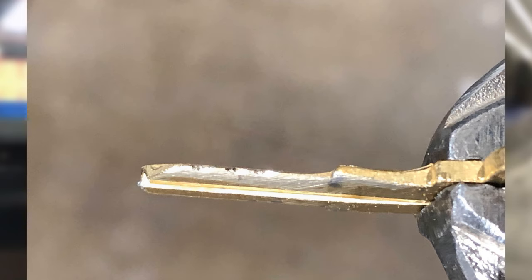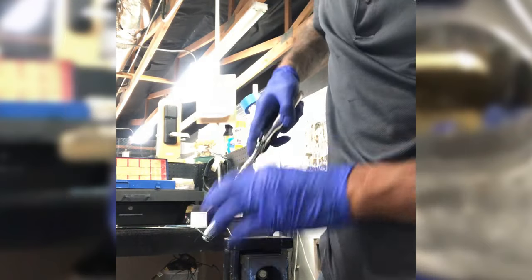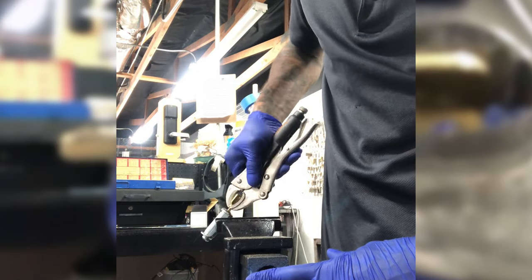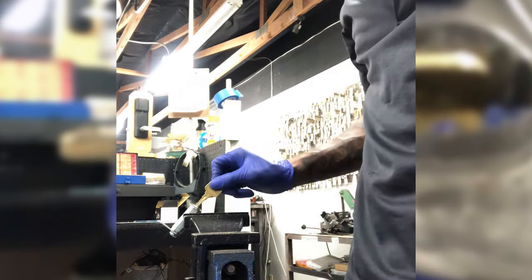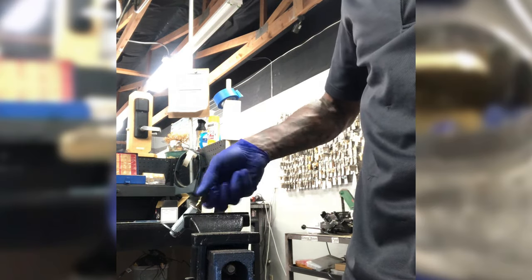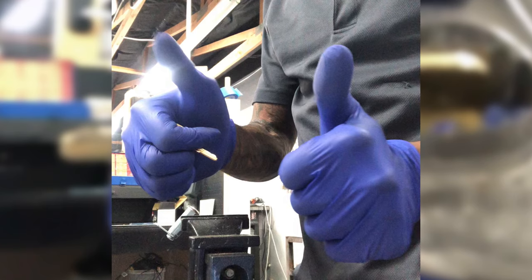He's going to file that down a little bit more, and this is what it looks like after his second filing. He puts it back in, gets a new set of impressions, finds the new mark, and this is what it looks like after his third set of filings. Eventually you'll put the key back in to get a new set of markings and find that when you're doing the twisting and turning, the key will actually twist over — because now you're so close that the key will actually spin in the cylinder. Fine-tune the key just a little bit, and once that key is opening the lock nice and easily, you've got the cuts you need to make a fresh key for that lock.